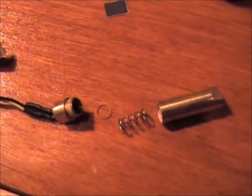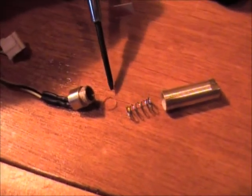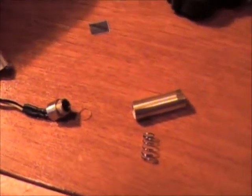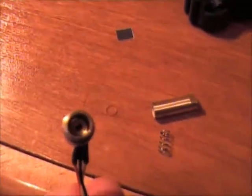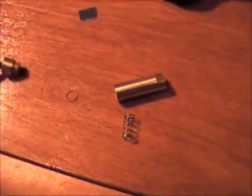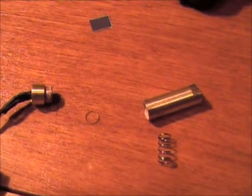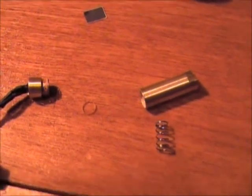This little laser module unscrews right here. The little laser module itself is right inside there. There's what looks like the thinnest little tiny copper washer you've ever seen, a spring, and then the little lens is inside this tube and it all screws together — it was Loctited. I couldn't find any labeling on it to figure out who makes this module. The piece is epoxied in. As long as we can get a laser with a decent spot that doesn't diverge too much, I don't think it'll matter, but I'll keep digging.